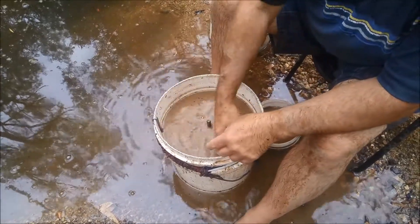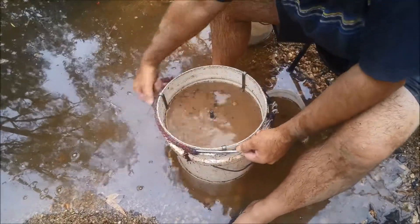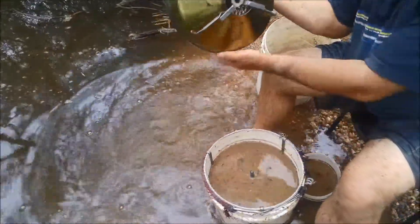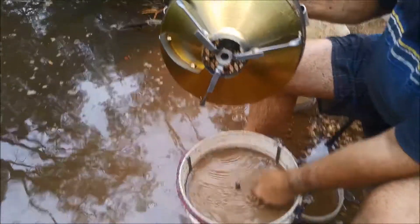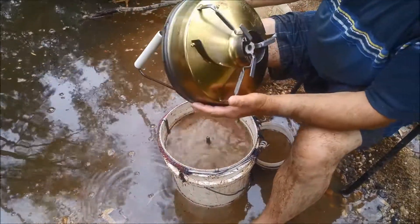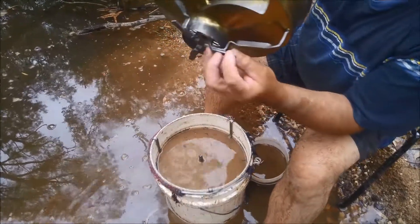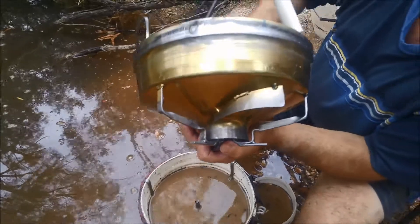You just press it and you can see that they're nice and flat in there. We just put a hockey strap on there to stop it spinning around. In there you can see the bush that I've made — I've just pressed it in and there's probably about 10 to 15 thou clearance on that. It just makes it a lot easier on your hands. On one side I ground that edge nice and flat instead of it being rounded.